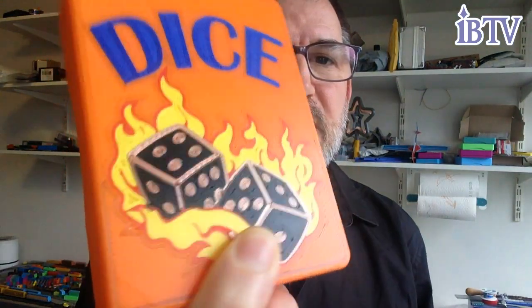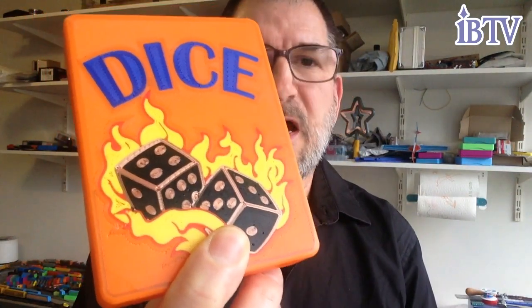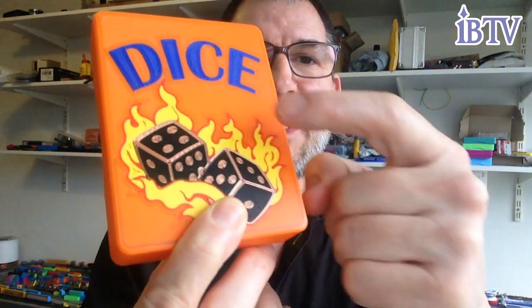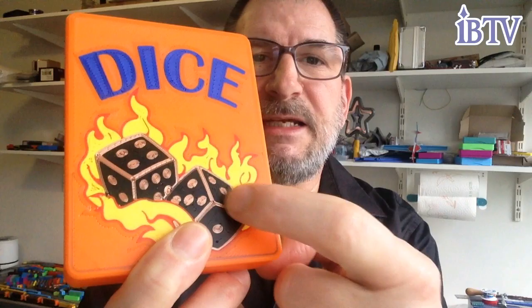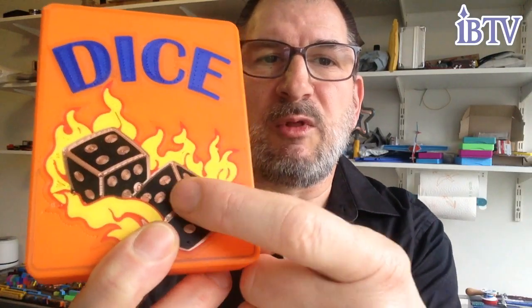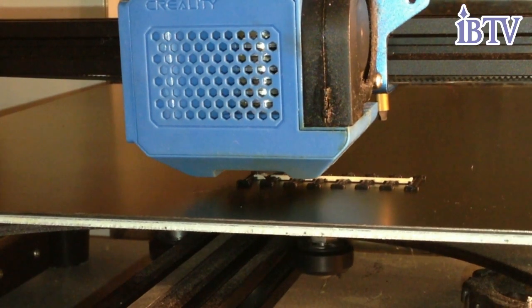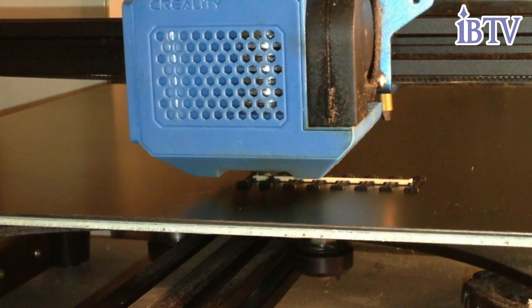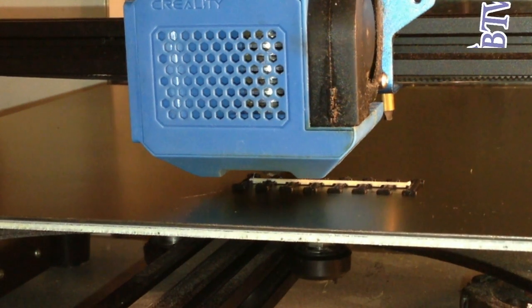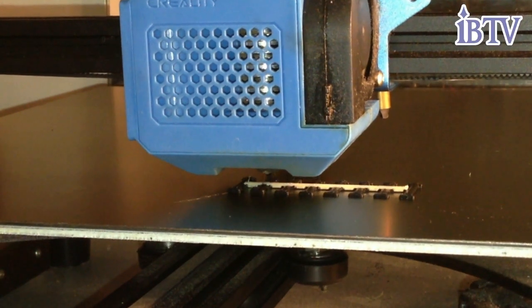The first Z-Hop video is about how to do a Z-Hop on the first layer. The Z-Hop gives you a nice flat layer — basically the Z-Hop causes the printer head to bounce over the top of the previous print. That way you can print yellow and then get inside of it for the red, black, copper, or whatever, and not knock the other things out of the way. Z-Hop is basically a vertical retraction, so every time the printer retracts, the printer head moves up.